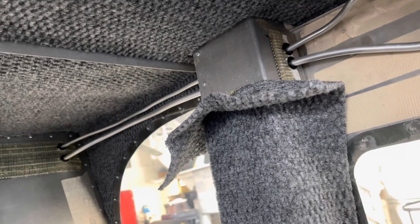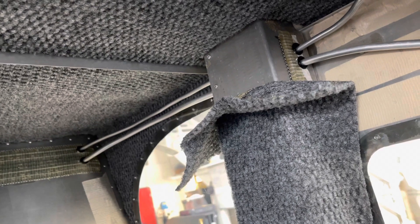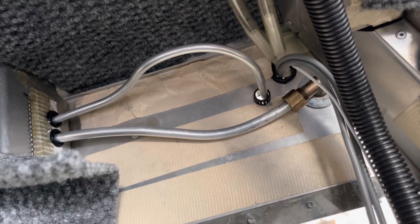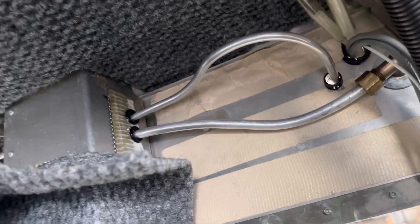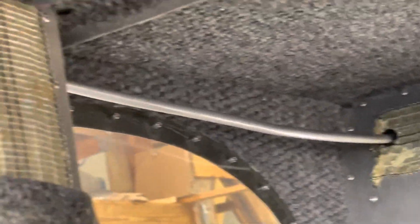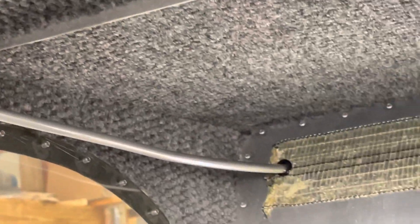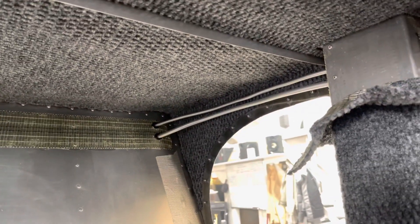It's another way of doing it — we've always used hose and still recommend either one. Hose is great for the run up to the engine because it takes vibration and high pressure, it's easy to route, and the chance of leaks is slim. Here we ended up with compression fittings, which is also working nice. We have a feed from each side and it's a little bit skinnier than running hose. We got one on each side and just ran a vent on one side, then continued that right into the header tank with another compression fitting.